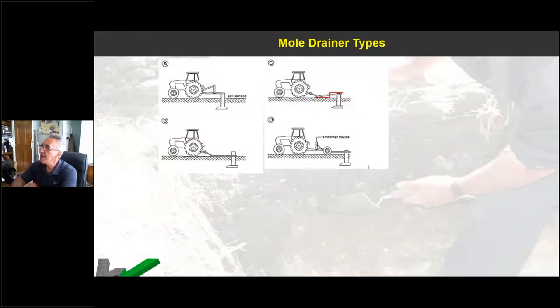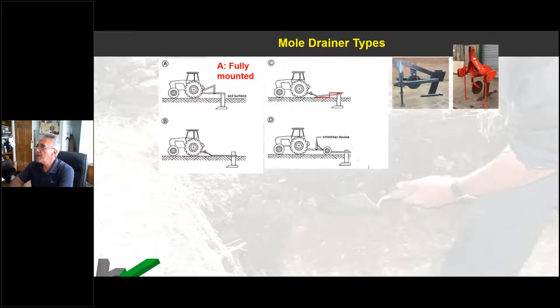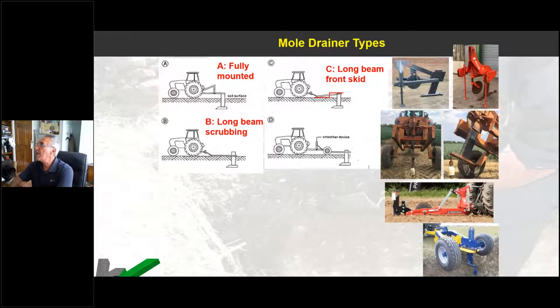The other action backfill gives you is where we've got subsurface flow. Often the transition between topsoil and subsoil — going from a more structured, higher organic matter content soil to a higher clay content subsoil — water can naturally flow along those lines, a bit like a damp proof course in your field. Where those lines are intercepted by backfill, you get the ability for water to be taken down through to your main drain. So backfill, although expensive and heavy to cart, has a very key part to play in efficient and effective drainage.